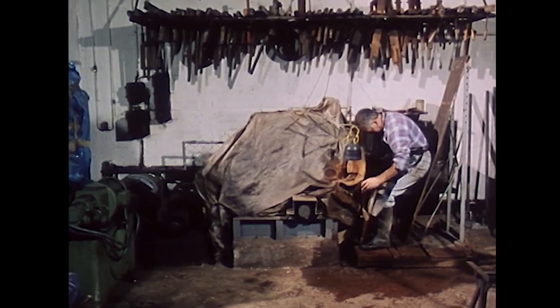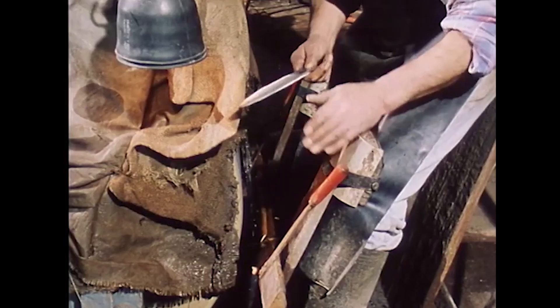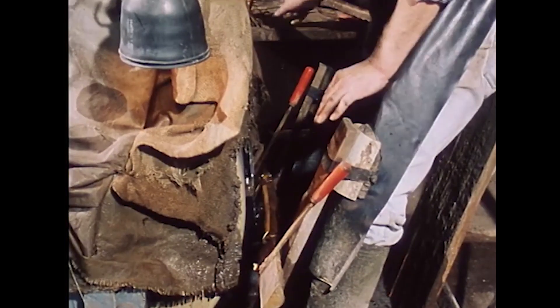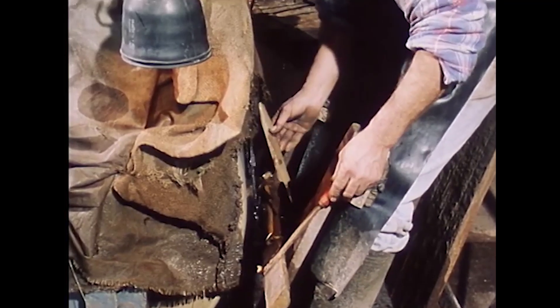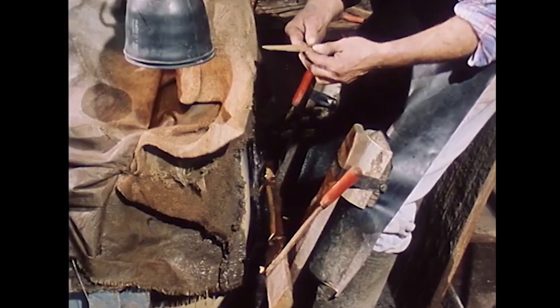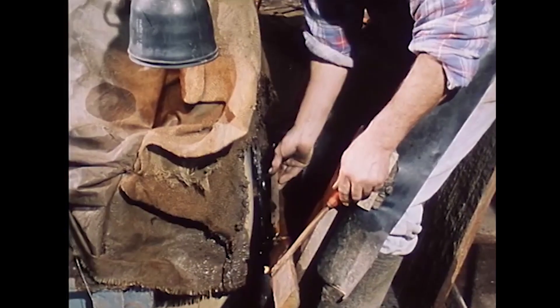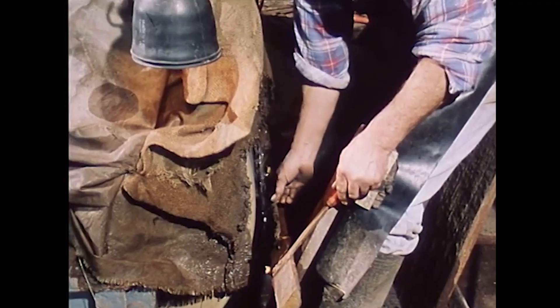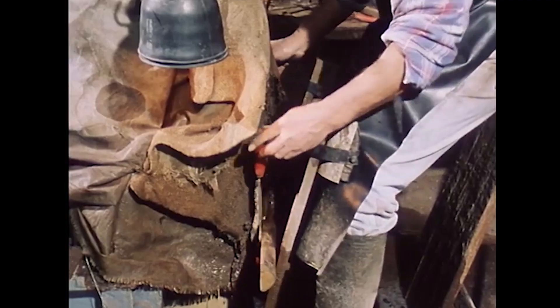Standard files are processed on the grinding machine. For other types, a large wet grinding stone called a knee stone is used. The worker uses covers and knee pads to protect themselves from moisture, which can lead to rheumatic conditions. Working with natural stone used to be even more harmful, causing the lung disease silicosis — today, artificial stones are mandatory.